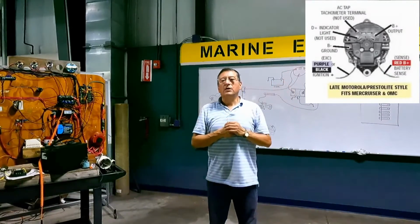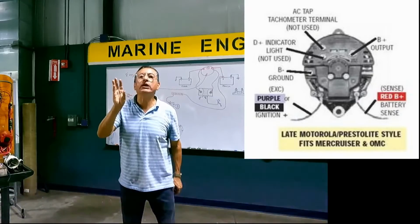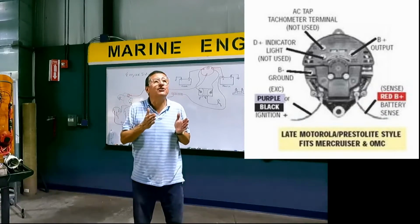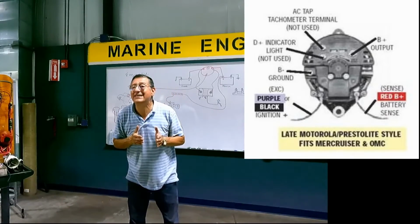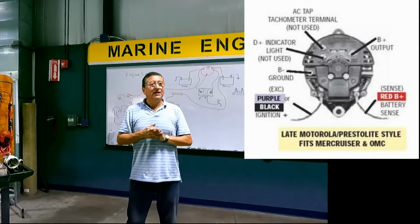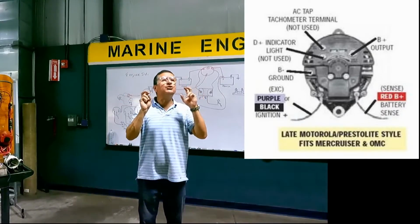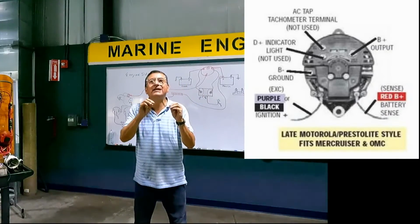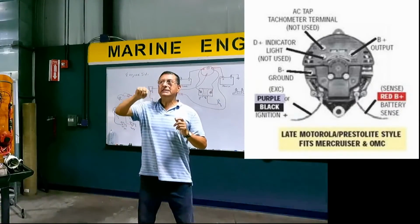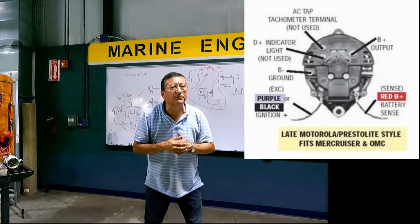This one, guys. Look, all the alternators have one output of a DC current, other output of AC, because remember, the alternator in the first step produces AC. And after that, with the bridge of diodes, it is rectified into DC. For the tachometer, what signal do you think is better to convert into revolutions of the engine, RPM? The AC signal or the DC signal? Which one is nice to convert into RPMs?